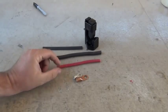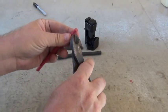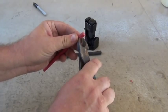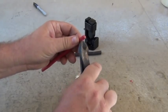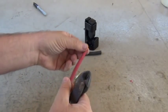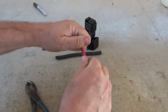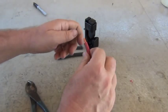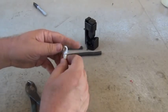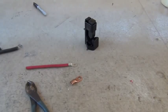We're going to do two wires today, starting with the 6 gauge. We're just going to work around it with the pliers and cut the insulation away, then pull it off. You want to give this wire a spin before you put it into the lug — that will help bind up the little wires. And stamping on wood is not a good idea.